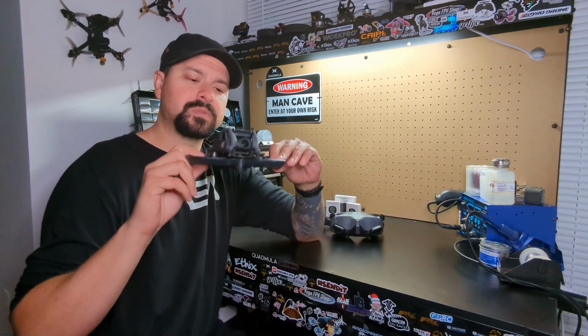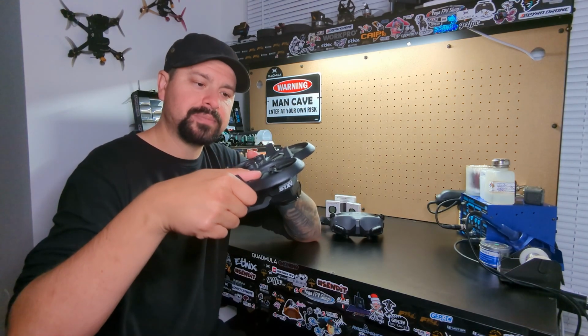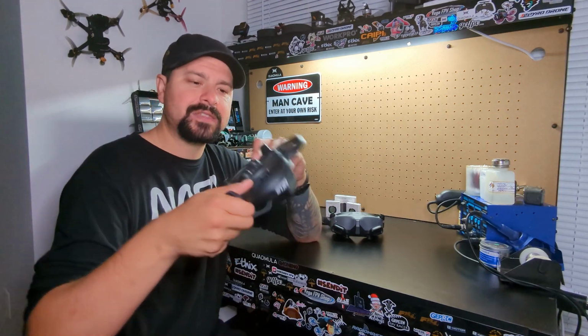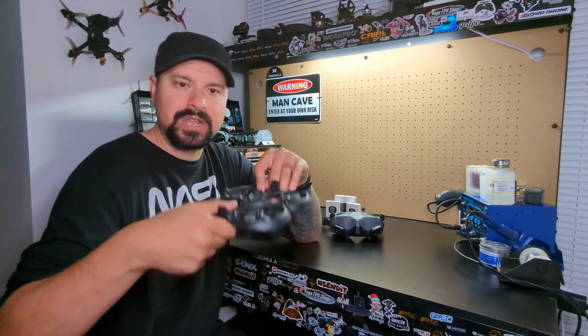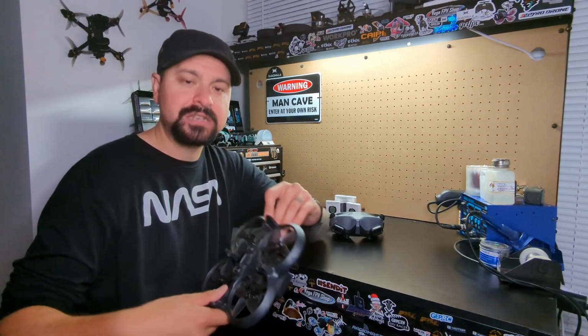I've also seen issues where people have done this maneuver, and because the flip happens so abruptly, it's like the flight controller and the GPS module almost got out of whack, and the drone doesn't know the difference between up or down or even where it's located at. And in that case, it starts to sort of power down into the ground directly and even cause more damage than what it would have if it had just disarmed.